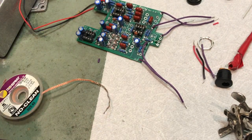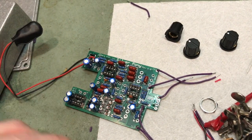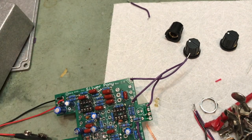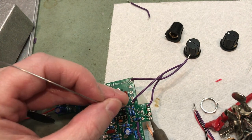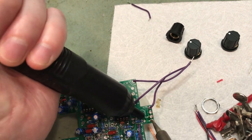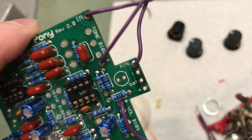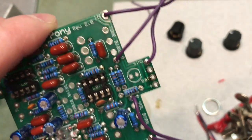That way you don't get that little bit of residue dropping back down onto your board, which is just kind of a pain. I'm gonna throw something underneath there so I can get a little pressure on it. So once again, you want to add a little bit of solder, which is a little counterintuitive. You're not really adding solder, you're just adding some flux to make the solder flow a little easier. And there you go. 2 different methods of de-soldering. Fun, huh?